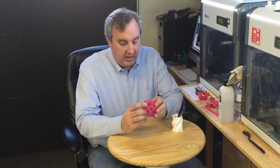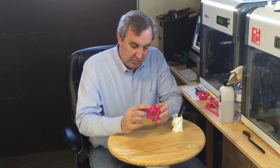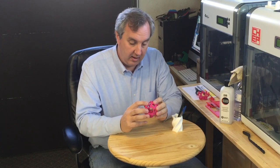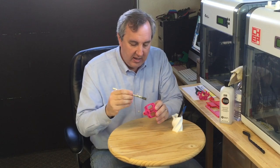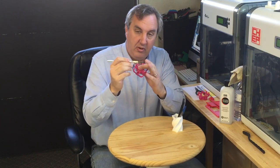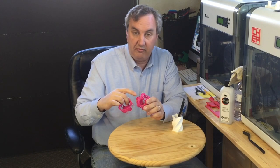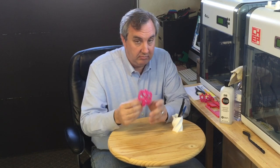Here it is all finished. It's a little bit grainy looking, but not too bad. I could smooth it out with some acetone, using a q-tip or a rag. I also found horsehair brushes at Harbor Freight — a pack of 30 for $3. They work great: just brush the acetone right on, then you can throw them out, and the horsehair holds up to the acetone. I noticed this one was a little smoother on the bottom without supports, so the supported areas got some rough edges. That may be an option if you want to make it look better, but overall they printed pretty good.